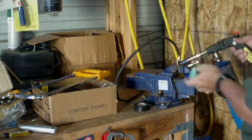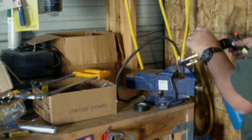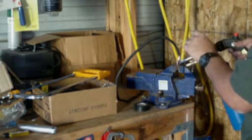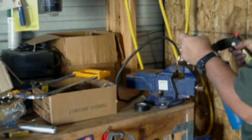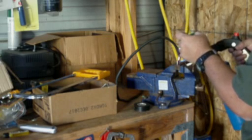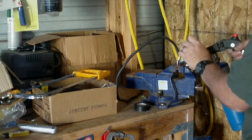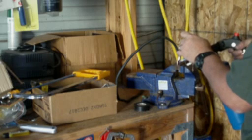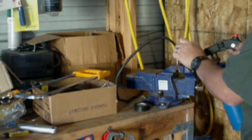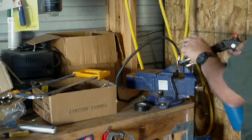This is kind of why I said you want to get a thick solder wire. Then just continue feeding. You feed it and you feed it. You can see that it's hot enough that it will melt and be drawn in. If you see it's not sticking and it's spilling on the outside, that means the terminal and cable are not hot enough. So just keep that flame in there, move it a little bit, continue applying heat. You can see it will get drawn in — just keep doing that until it's nice and full.